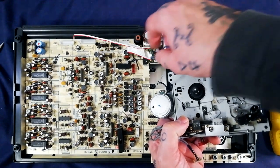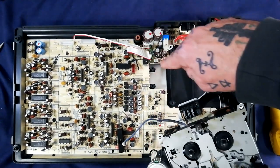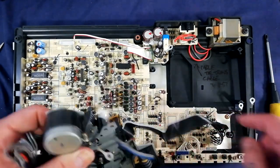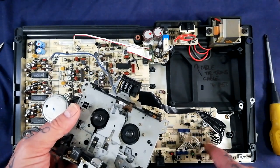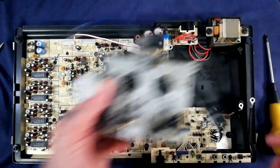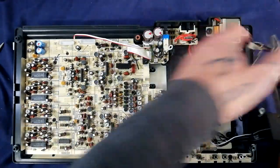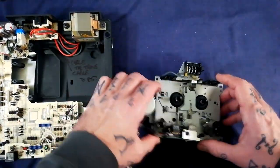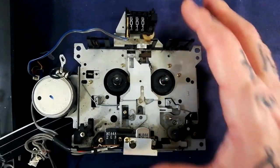The counter is mounted onto the transport so we'll need to detach it. On this board you can see that the ribbon cable is soldered in there, and unless you remove it from the original connector - which I don't recommend - it's going to be detached at this end, so you'll have just this much leeway to move things around. I'll push it over to the side and we can have a closer look at the transport in the MT120.